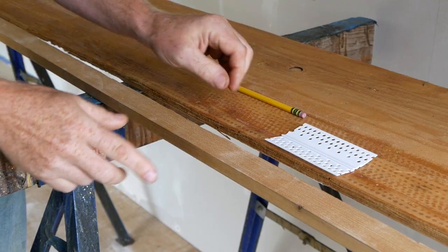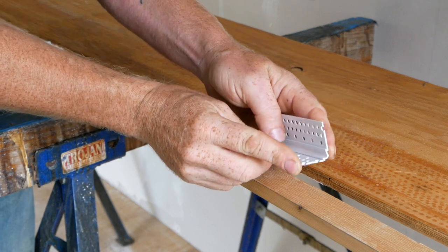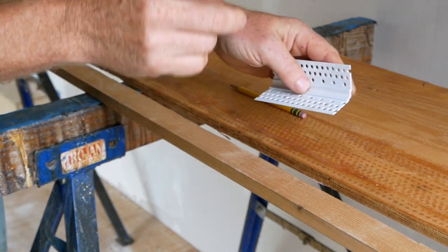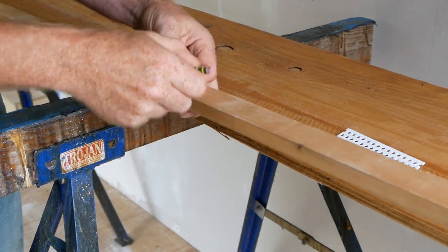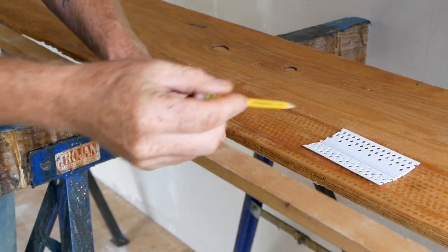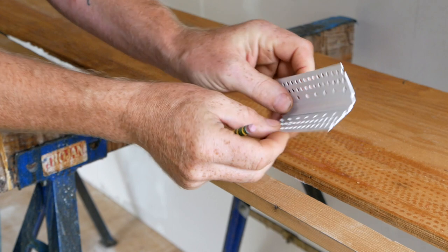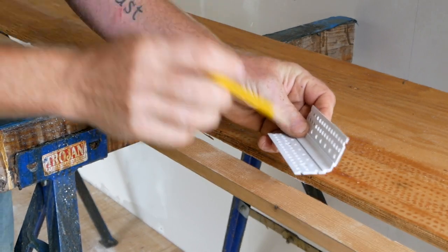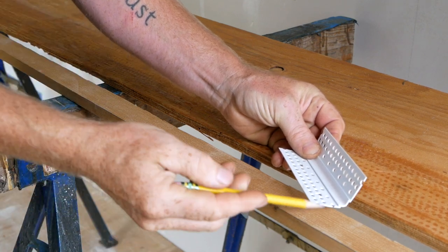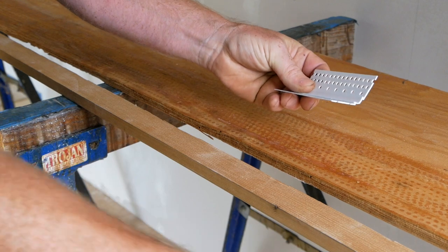I like to make a wooden batten that is as wide as the corner measurement — approximately one and three-eighths of an inch. You hold the batten up to the wall and mark along the outside of it on your corners, giving you a perfect alignment mark to stick this up onto the wall. The instructions recommend snapping a chalk line, but from personal experience chalk lines are usually not very accurate, so I think the batten is a much better alignment solution.